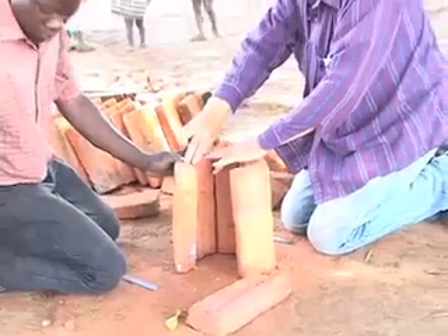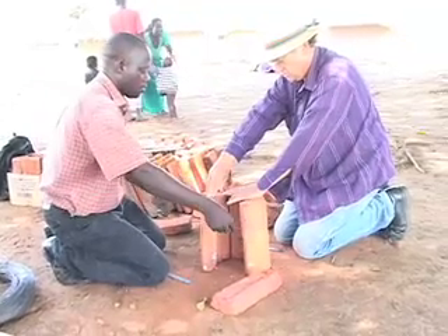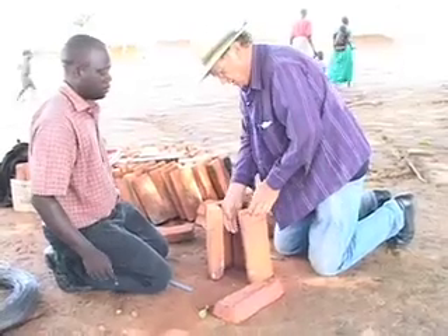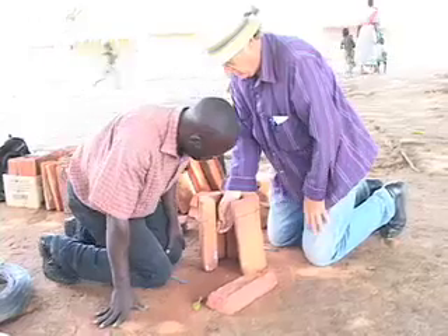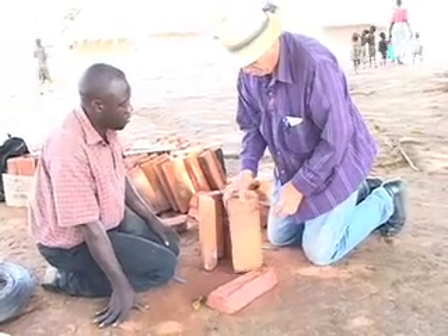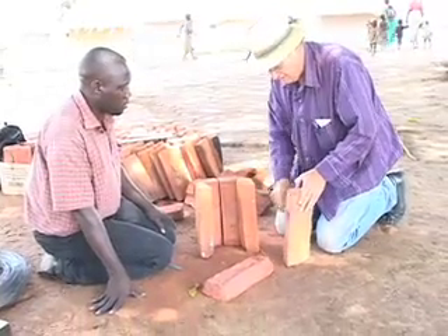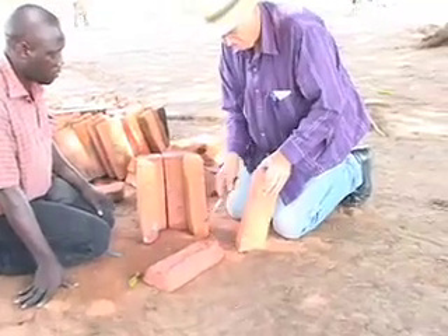Where's that piece of wire we just had? You want to put that around — this is just to keep them from falling over right now. So now we know we're going to notch this halfway down to make a little shelf, a little lip to hold this center brick so the center brick doesn't fall. We'll take this out and we know we're going to cut it on this side, and we can also clean the edges up just a little bit.